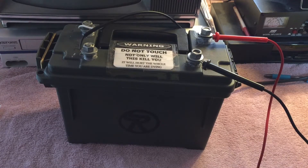It's just to hook the transformer up backwards. So instead of stepping up 120 volts to 2,000, you'll be stepping 120 volts down to whatever. Then you can do the math to figure out the ratio of turns, and then do the math again to figure out what it would output if given 120. It is important to first measure what your outlet is actually outputting, because it's not always exactly 120 — it might be 119.5, it might be 122.6 or something. If you want the exact math, you're going to want to measure that.